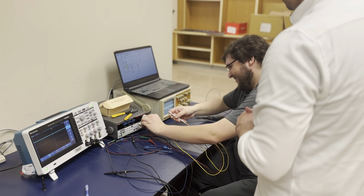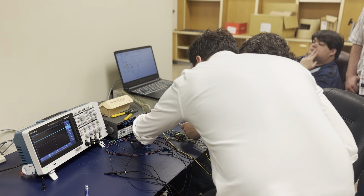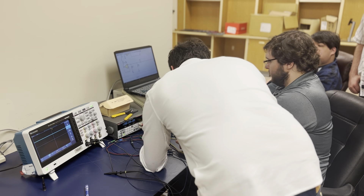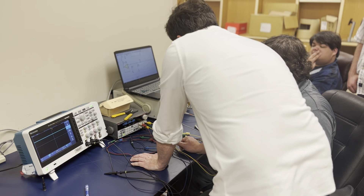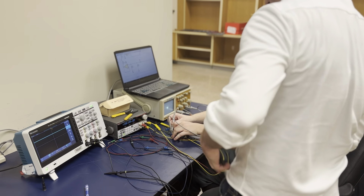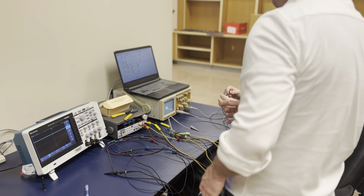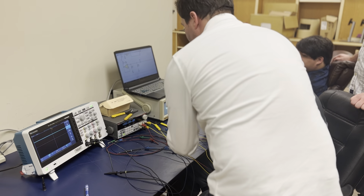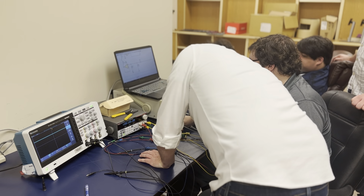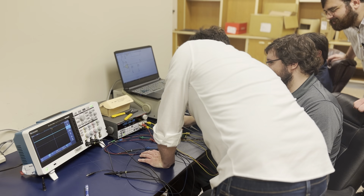There's something going on here where one of these resistors is not right. It's giving you still chaotic behavior. Let's look real quick — let's see if we see a cool phase portrait. That's the money shot. So we want to look at... put the probe right there. Put it in X-Y mode. You've got the analog scope for the phase portrait? Just put this guy on here. You just need one of them. Oh yeah — smart. Put that one right there. Oh yeah! So there it is — y'all have what I would call a folded band oscillator.